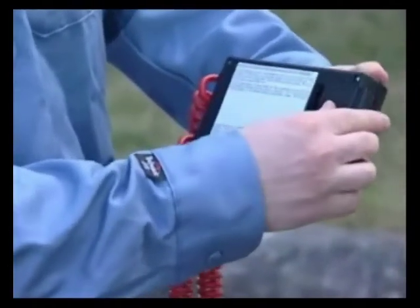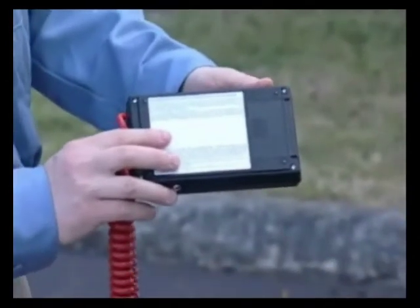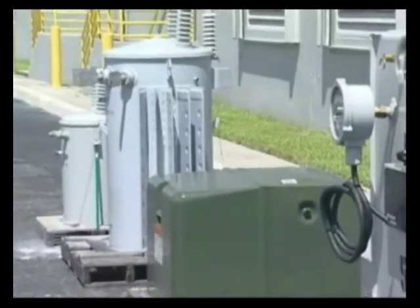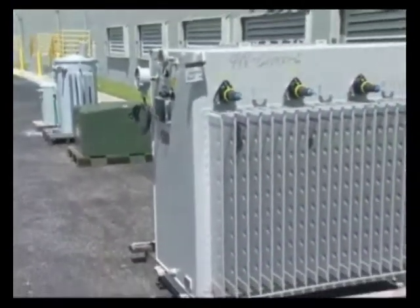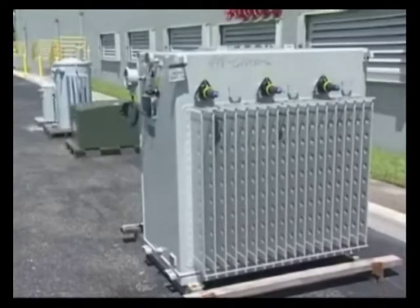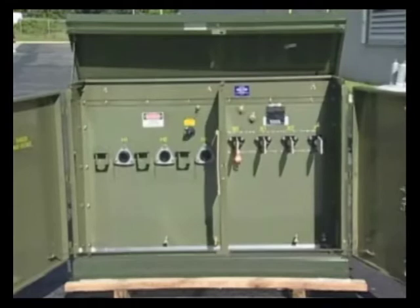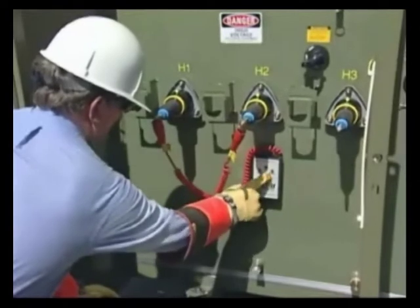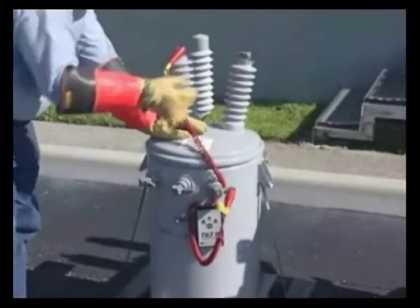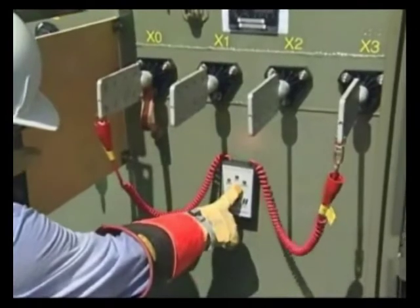There's a low battery feature so that when the battery becomes low, it will not allow the unit to operate and no lights will come on. The Tilt can be used to test any de-energized transformer, single or three-phase, overhead or pad mount, from small transformers including instrument transformers, to very large transformers including any distribution class transformer. Unlike a simple ohm meter, these instruments use a high-frequency, low-voltage signal to measure the transformer winding inductance and power capacitor capacitance, and can differentiate true shorts from other low-resistance windings.